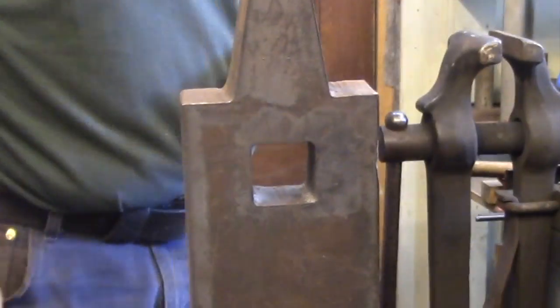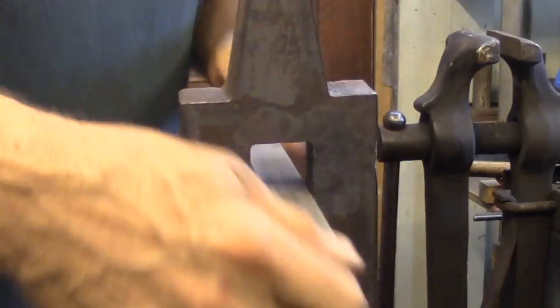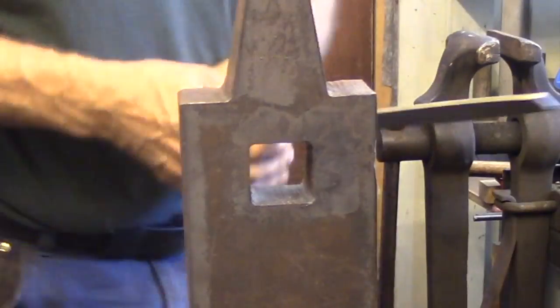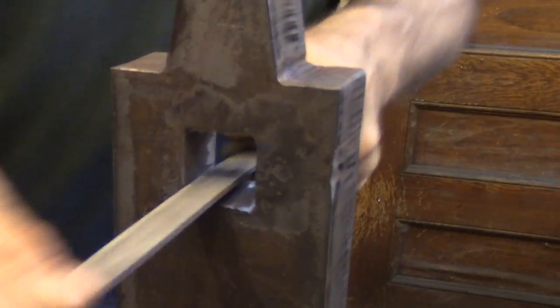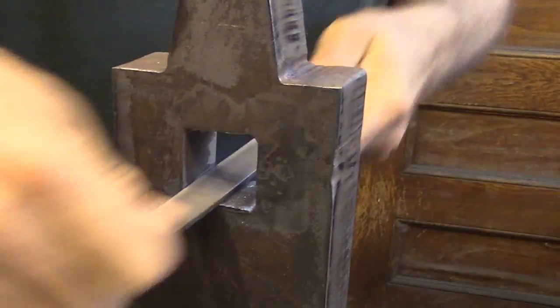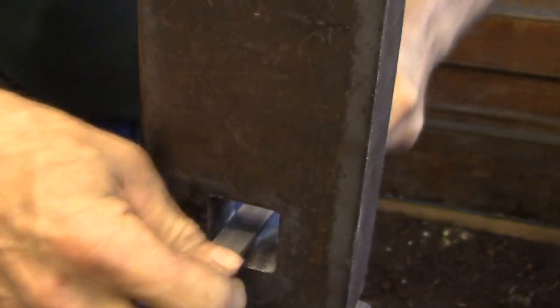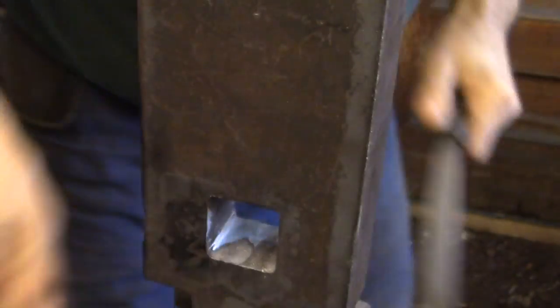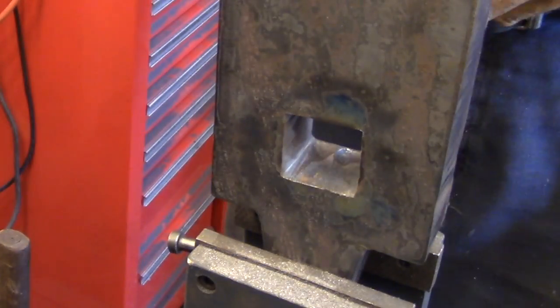There's nothing mysterious about this part of the process. You just do a little bit of filing, test it, do a little bit more filing, try to estimate where it's jamming up, and then take the metal away in that spot. I'm in a bit of a hurry here because I need this in a couple of weeks, but when I do the other plates I'm definitely going to set up a furnace and fully anneal the whole block, which will speed up this process tremendously. I'm also probably going to make one of those miniature belt sander grinder units that fit into tight spaces. I'm also test fitting the piece quite often because I want to make sure I don't remove too much material and make the hardy hole too sloppy.